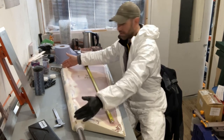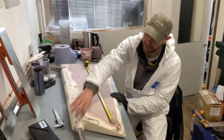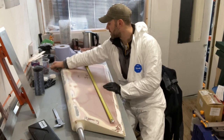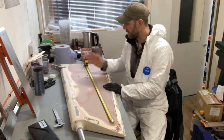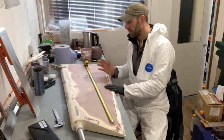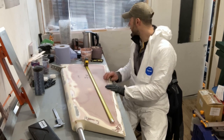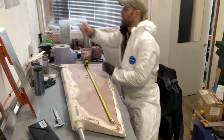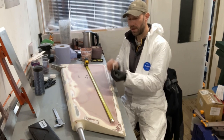And the rudder's currently at 940, but I've got to put in some space there for the rim of the top hat on the bearing here. And the heel plate, which has had a slight mod done on it, is ever so slightly higher than it was previously. And that brings it up to about 946-ish, something like that. And I have already pre-made some different thickness spacers, some little packing washers of between half a mil up to about 2.5 mil here.